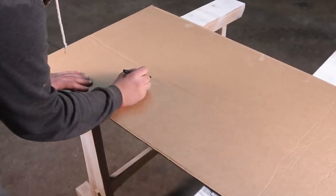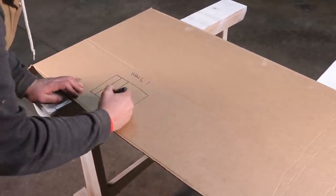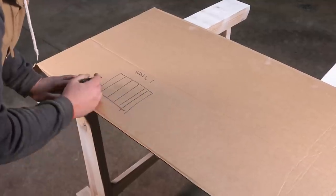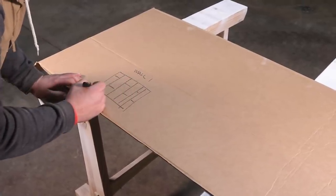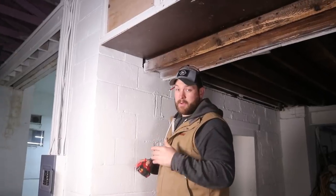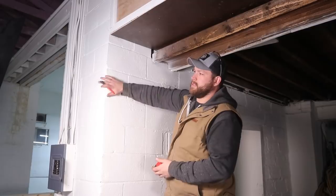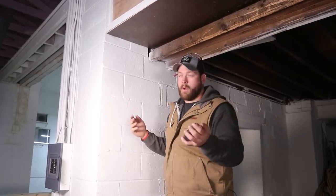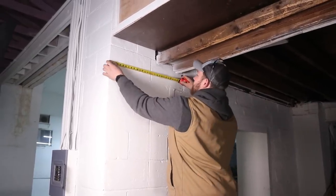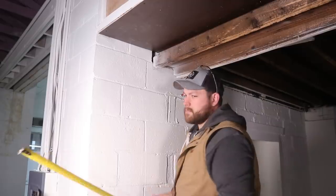We've got two walls to build and the first wall is just going to be your standard stick-framed wall. We're going to run our top and bottom plate, then all of our vertical studs with some spacers in there as well. We'll toe-screw everything in. My experience when framing: most homes around here are never square. So pick an area to reference off of and use that to find your square. We're going to use this surface and wall to reference instead of the beam up here, because this beam is not square or equidistant on both sides. So I'm going to reference 19 and a half inches here and drop a line down.